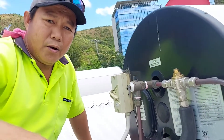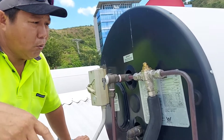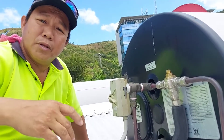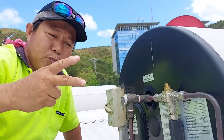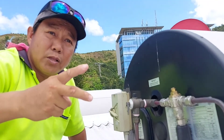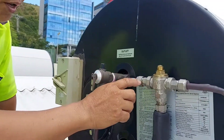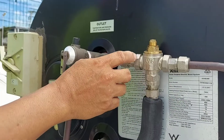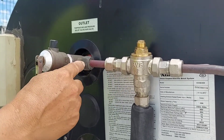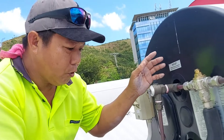We are now on top of the roof, trying to find out the trouble. The complaint from the tenant is there's no hot water — they have water pressure but no hot water. We have two options to consider: first, the hot water line is not connected; second, we need to open this unit because inside they have a filter. We'll check what's inside — maybe there's a blockage. There is a source of hot water, so it means the tank is full of hot water.